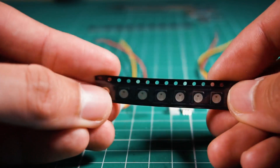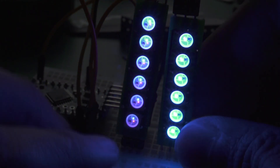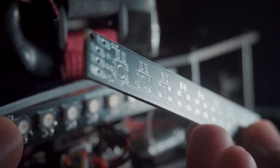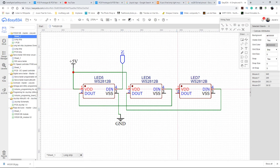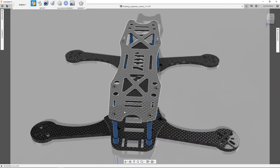The LEDs we're going to use are the WS2812B. These are very popular RGB addressable LEDs, which means you can control each individual LED by just one wire of data — that is very easy to connect. We'll only use 3 wires: ground, 5V, and data.